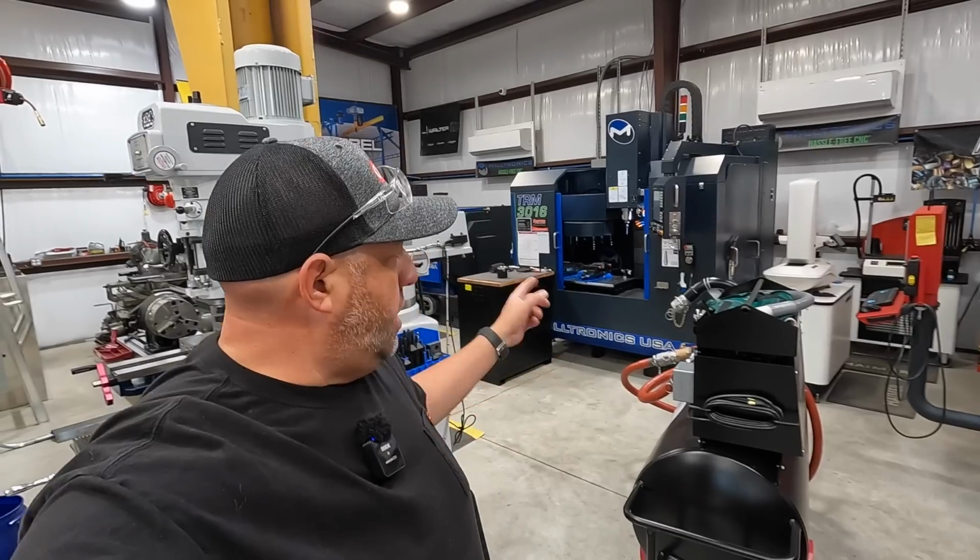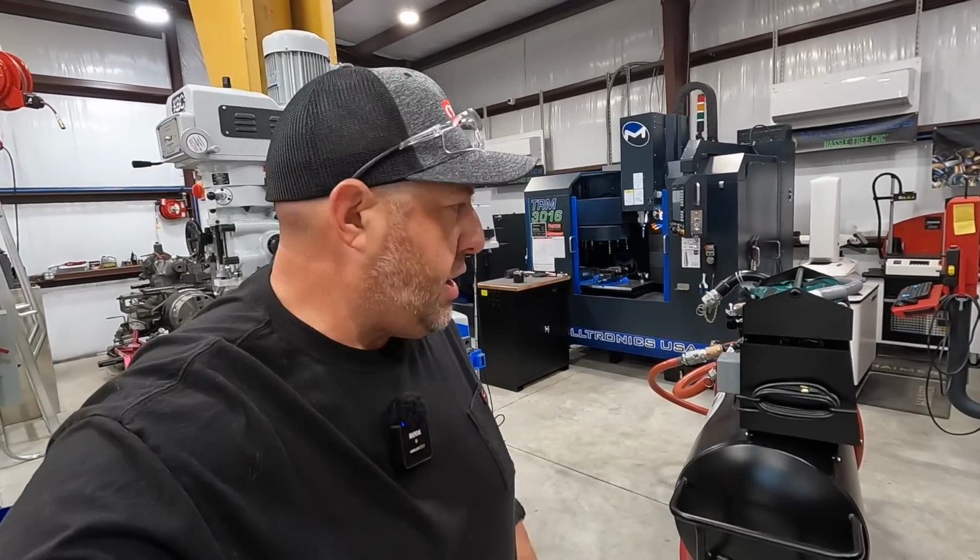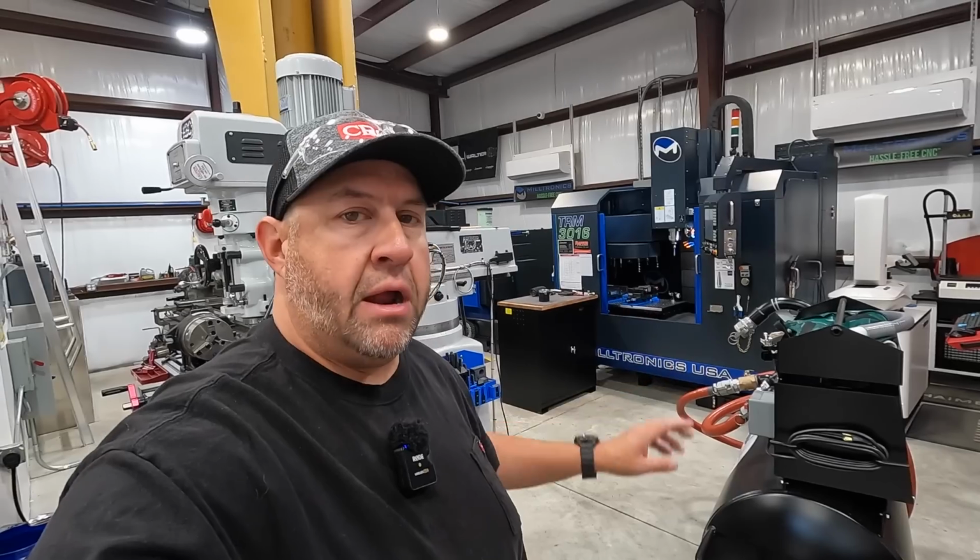Hey guys, I'm going to be doing a little bit of maintenance over here on the Milltronics CNC mill today. What I want to do is go ahead and extract all of the old or original coolant that I put into the machine when we first fired it up. My intention is to have the Trim MicroSol 685 coolant in all of the machines here.